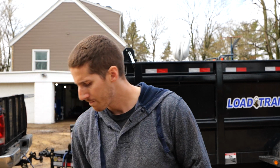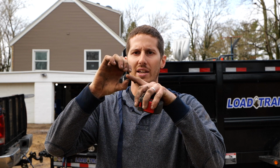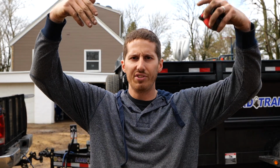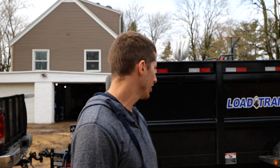But I do well with these two things. I load this trailer up all the way. When you have wood pieces and logs that need to go up there, sometimes you tip grab them like that. Instead of having them inside the grapple, you let them go and they just fall, because you can't tilt that thing down unless you're all the way up, hinge pin all the way up to the sides. It's not high enough to tilt down above the trailer, so you're tilting down inside the trailer, but the grapple is able to do a tremendous amount of that. If you don't have the grapple, you wouldn't be able to load quite as high of a load, which probably wouldn't matter as much because things you'd be loading with a bucket would be much heavier. But I have really enjoyed using these things together.